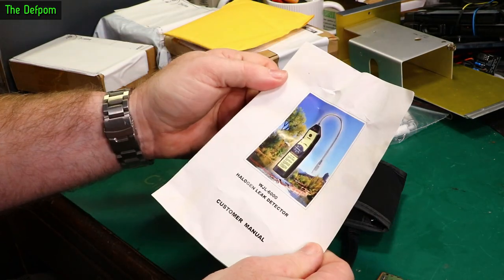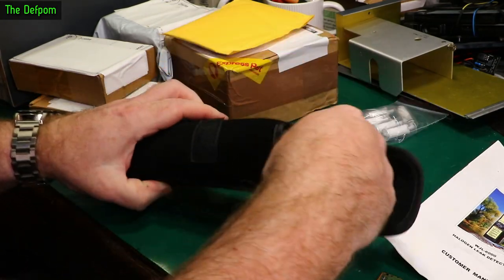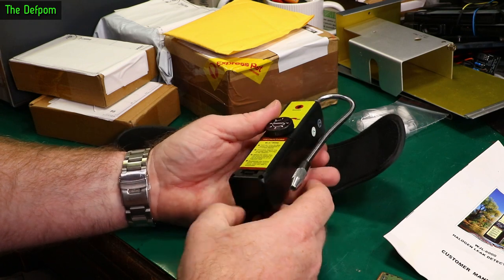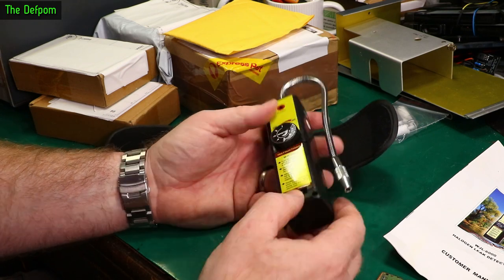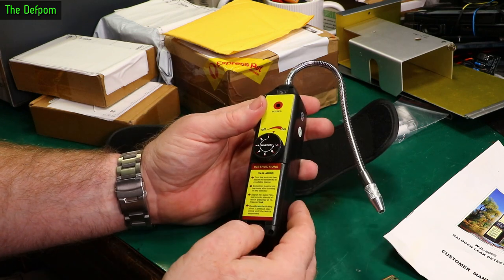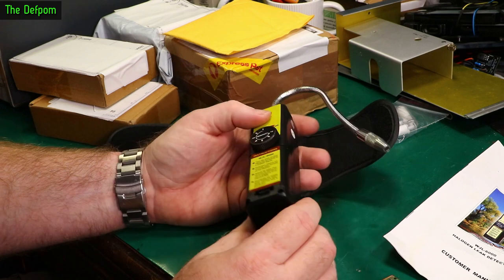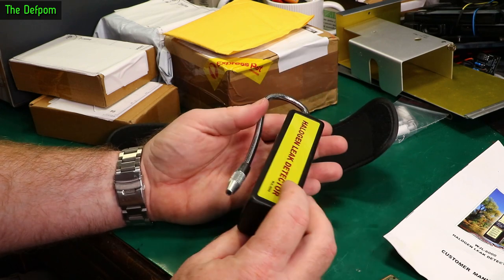What's the instructions about? Halogen leak detector. This is also for working on air conditioning systems and you can use this to check for leaks of refrigerant systems, amongst other things. It's a sniffer - you just put it around to try and find out where a leak is occurring if you've got no way of actually testing it nicely. Like if there's no dye in the refrigerant you might not actually know where it's leaking out. But this might find small leaks. These are really cheap to get.